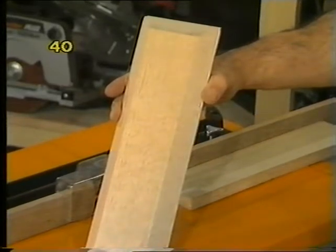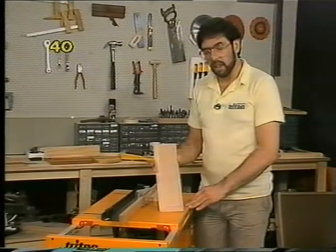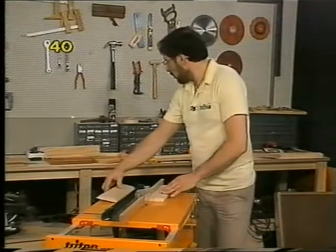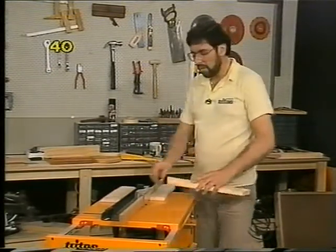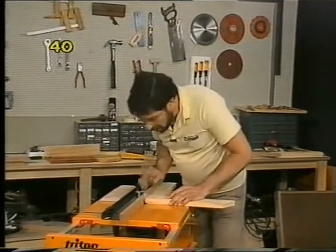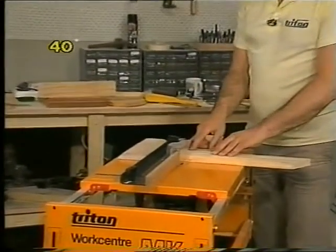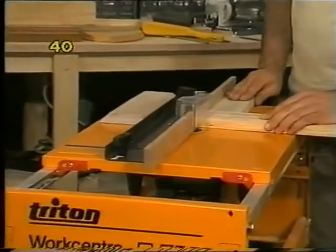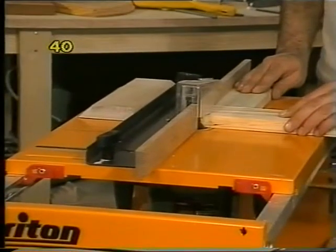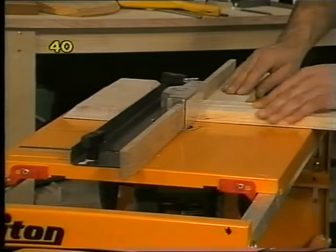For cross-grain work, you may want to convert back to your saw table, put your circular saw in with the blade angled at 45 degrees in the cross-cut mode, and cut them off with your saw. But if you want to use a router, do it in several shallow bites rather than one big deep bite, and use a pusher block — a piece of scrap — directly behind the workpiece so it helps you propel the wood square against the fence and protects the back edge from breakout when the router comes through.